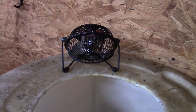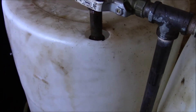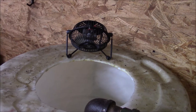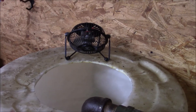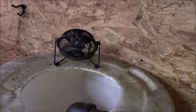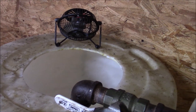When we're bringing the product into the drying vessel, the biodiesel is sheeting across the inside of the container. I have a small desk fan that's going to blow air across this thin film and remove the moisture — it makes it really easy for what little water is left to evaporate out. From the results of the 50-50 shake test, I'll go on record as saying this batch will dry very quickly.